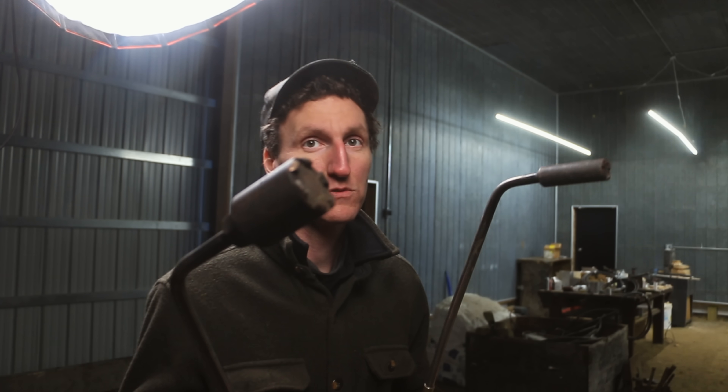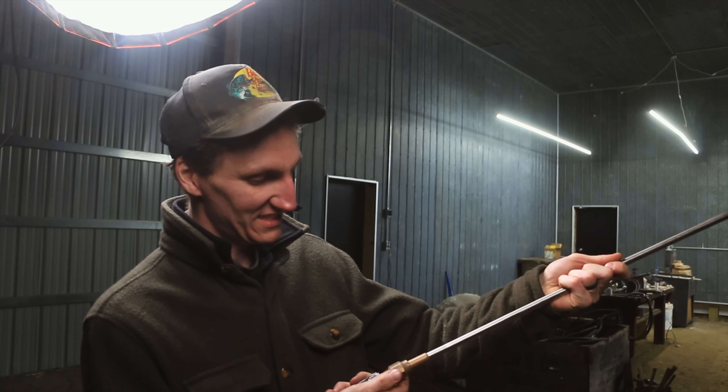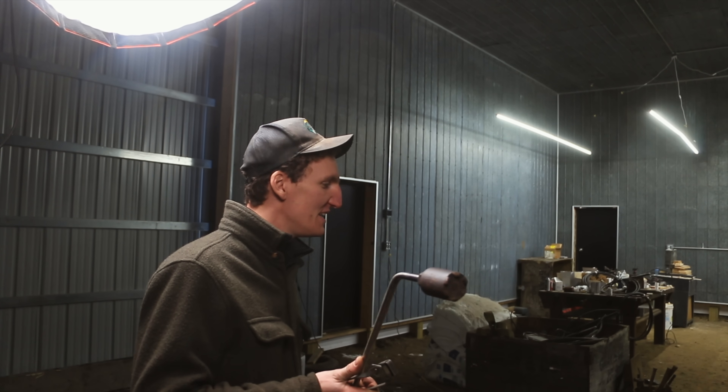A few years ago I got this because I had a job where I had to heat a 2-inch round bar - a really short heat because I had to hot-punch a hole in it. I didn't want the bar to deform so I was using this for localized heat. They boast that this rosebud can blast a million BTUs. I have a really hard time believing that actually. What I found out is it's so many BTUs that in the application of heating round bar, you're probably losing about 75% of it to the sides. So it's hard to find a good application for this - bigger surfaces like a plate would be better. It drains the oxygen bottle in about 7 minutes flat and freezes the regulators up.